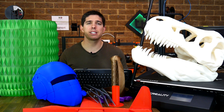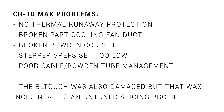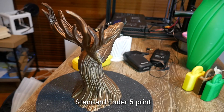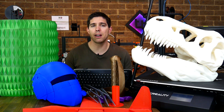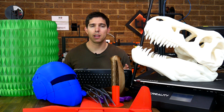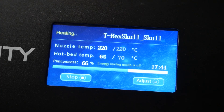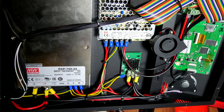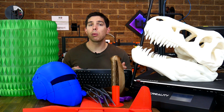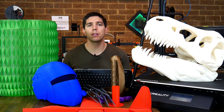So that's the good, the bad, and the ugly for the CR10 Max. If you compare the price to the list of failures I had on this printer, I think it's a completely reasonable position to state that this printer is a rip-off and not worth your time. I think it's fair to say that Creality quality control can be a little bit hit and miss. Both my Ender 3s and my Ender 5 arrived in really good condition and printed great out of the box. My CR10S Pro was a little bit average, and this one, not so good. You might get a great one, but I can only review what's in front of me. It is fair, however, to point out that the base hardware is actually really good. It has quality parts like the large touchscreen and the interface is really slick too. The genuine twin Meanwell power supplies get the huge bed up to temperature — 70 degrees in around 5 minutes. It has a genuine BL Touch, genuine Capricorn tube, and genuine Bontech extruder gears. Despite the obvious QC issues, you have to give Creality credit for attempting to put a printer together with really nice spec.